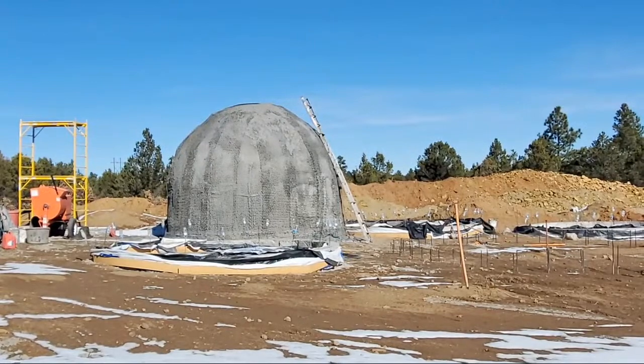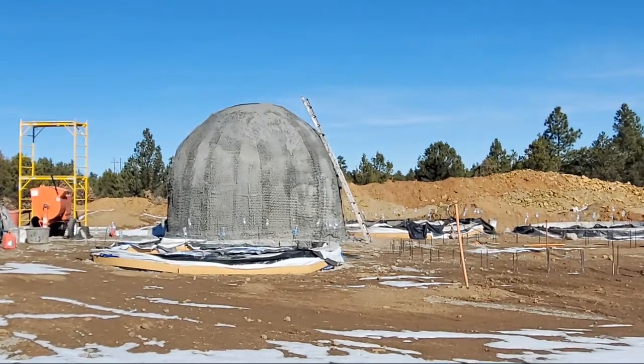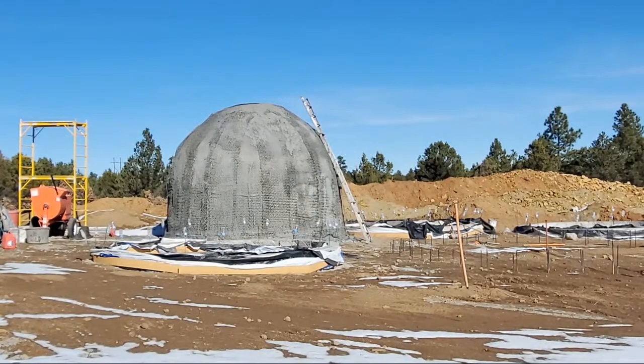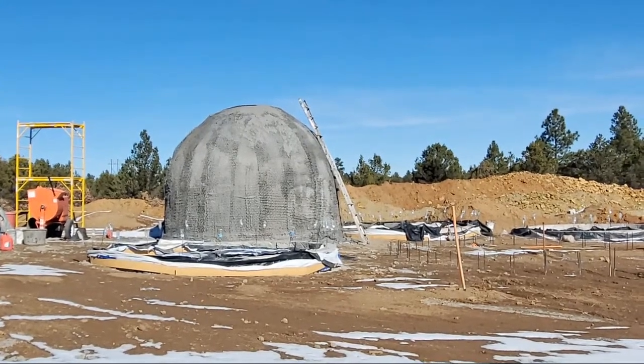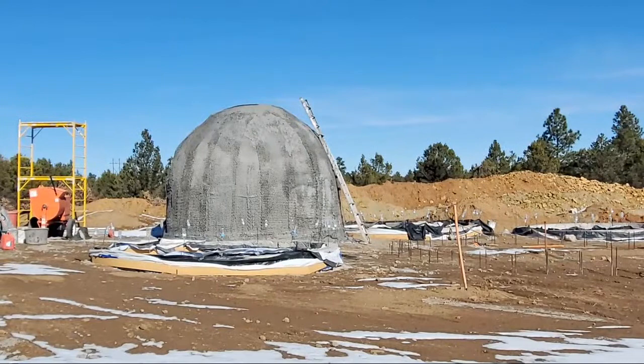Another good thing I don't talk about enough is that when making aircrete, you want to get yourself a hard water tester. Go to aircreteharry.com, click on the aircrete tools tab, and that'll take you to my Amazon page where you can see hard water testers. Hard water will mess up your aircrete big time because hard water does not allow foam bubbles to exist — it makes them pop. If you have hard water and your aircrete is collapsing, that's the reason. It's not about pH — it's about the water hardness.